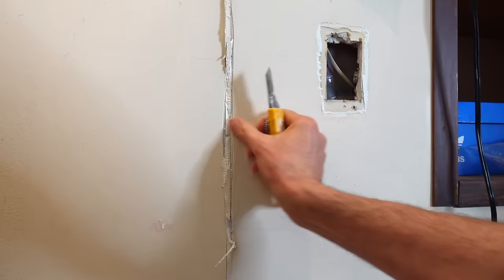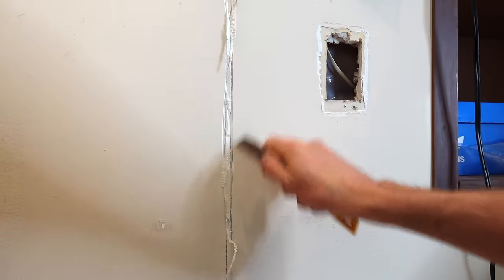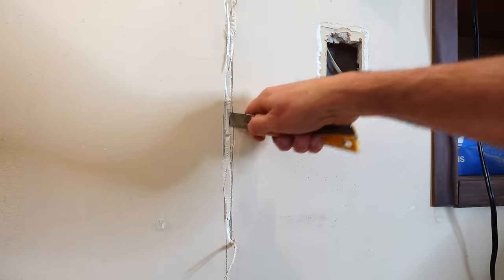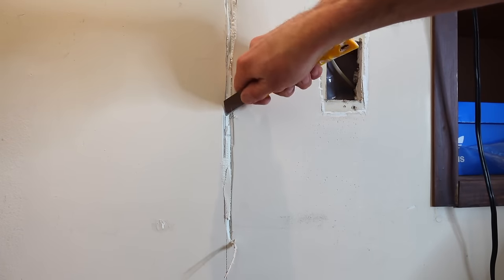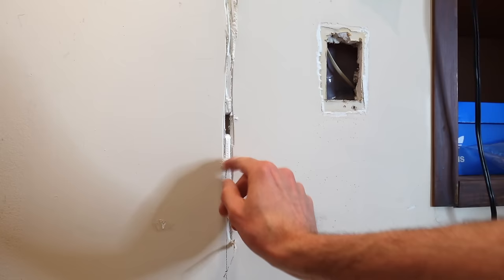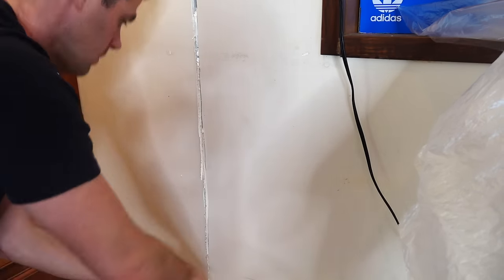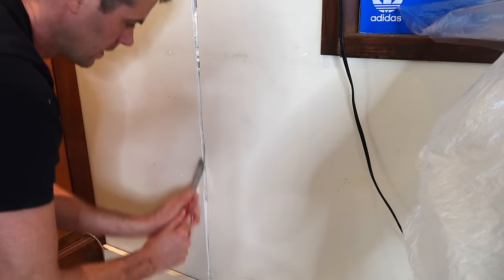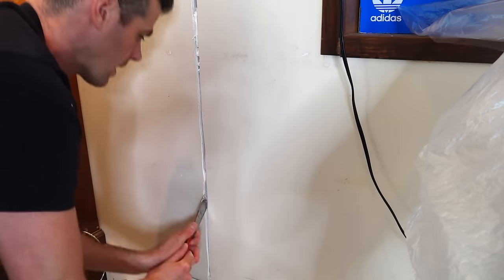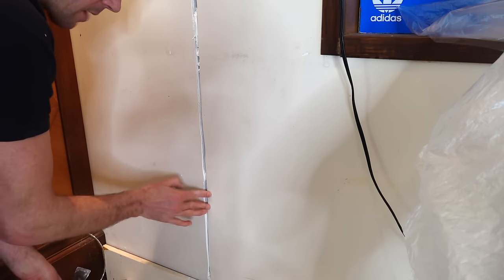There's not much build-up here so I'm not actually going to worry about pulling the mesh tape out and trying to get a recess. I'm just gonna carve enough of this out that I have a nice solid chunk in here, and ideally get the old mud out if I can. Basically, if we want to have a good shot at repairing this, we need to get it back to pretty close to square one in terms of being able to glue the joint back together.